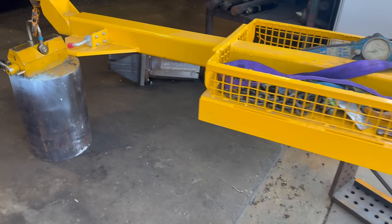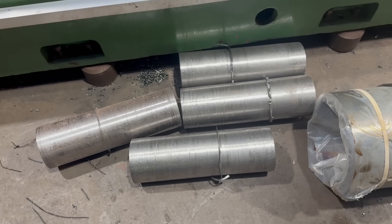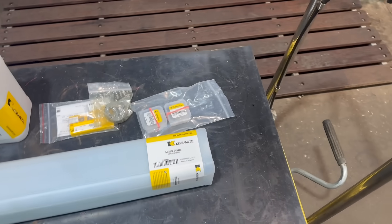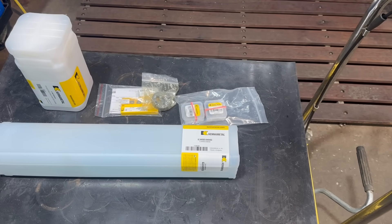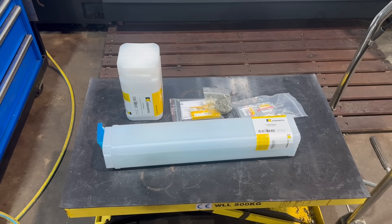We take a giant piece of 320 diameter steel, core it out, and I'm left with a 145mm slug, 600mm long. That is what I'm going to use today as the stock in my Colchester Alpha 1760. We're going to get to set up a brand new HTS drill — this is going to be the largest one the CNC will run. We're dancing with the edge of lathe power so we'll have some fun with it.